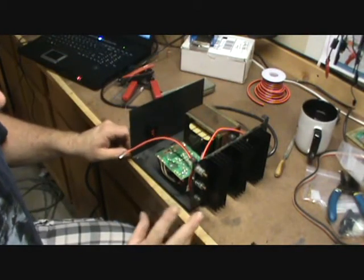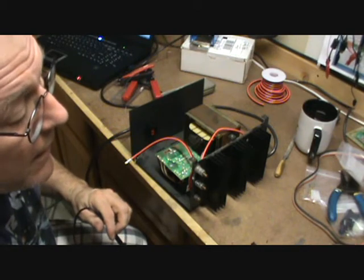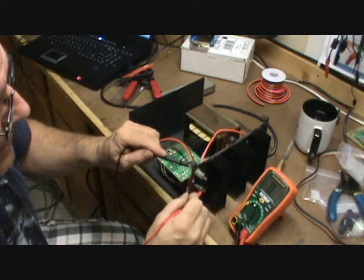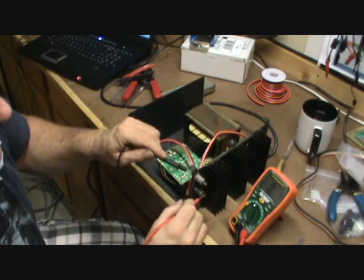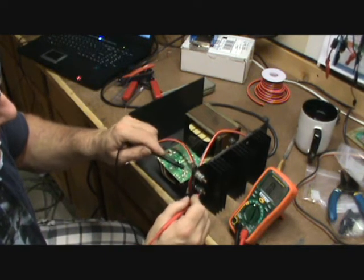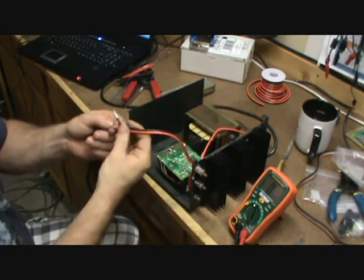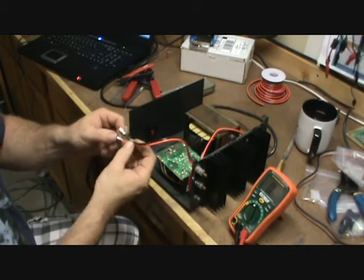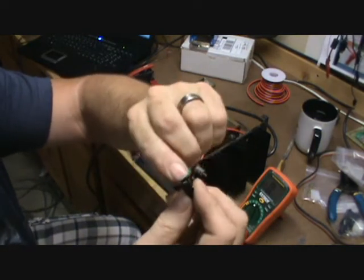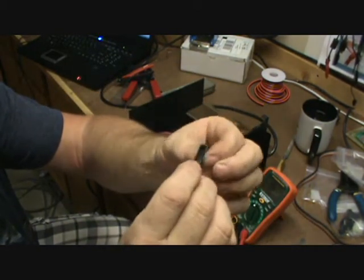Now we've gotten this far. One of the things I'm going to do since I've pulled these two mounting studs out is take a meter and check to make sure that I do not have continuity between these two pins. That tells me that I did not get this mounting post here touching the middle frame, and that my ground is good all the way through. Now all that's left is to physically assemble our poles, our connectors. If we look on these things, we have a little spring inside of here — and you want this curved back piece to go up against that metal spring.